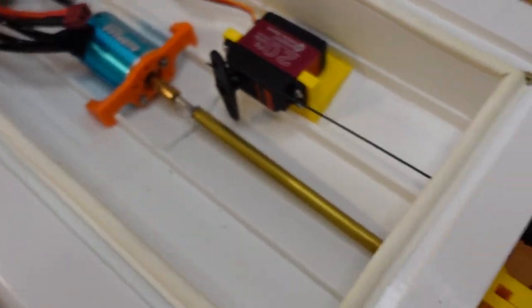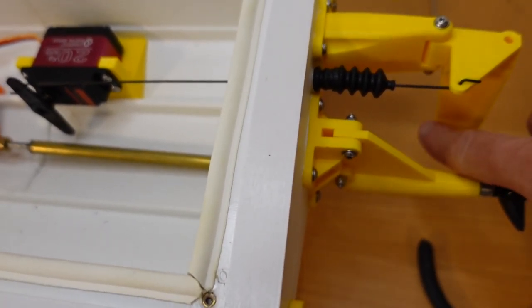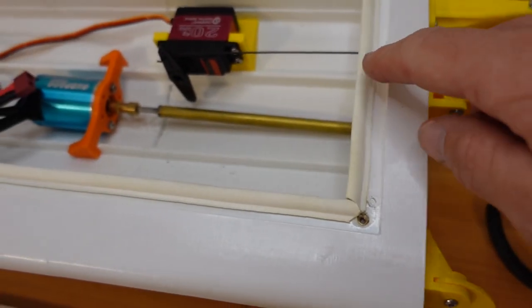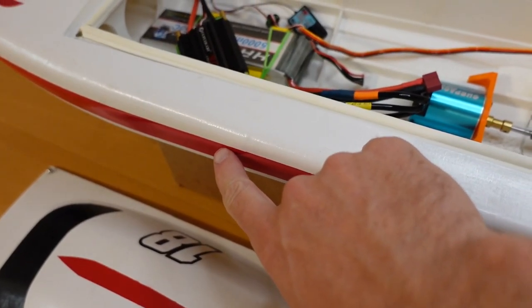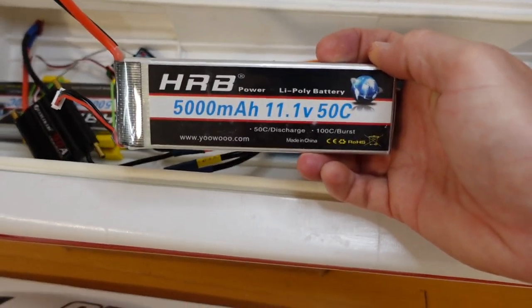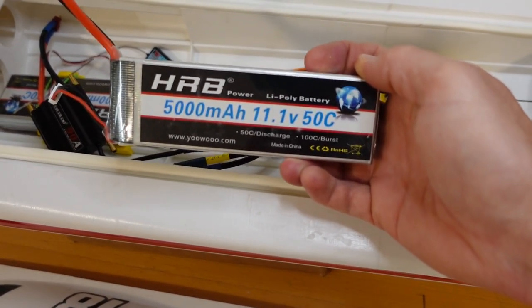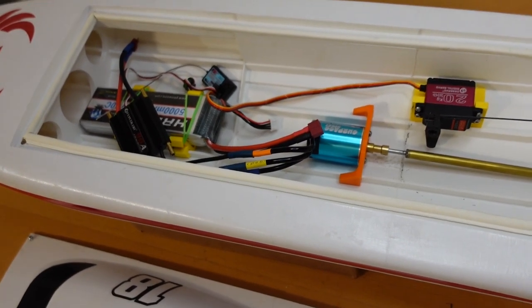The water cooling itself is going to run off of this nipple right here. Water will flow in through the rudder, up through this nipple. It'll come up through a hose into the back here, wind itself around the motor, and then probably out the side right here. The battery I'm using is one of these 5,000 milliamp hour 3S LiPos with a 50C discharge rate. And the performance I got was pretty good,